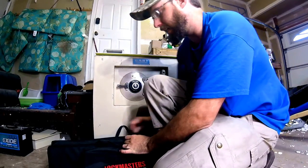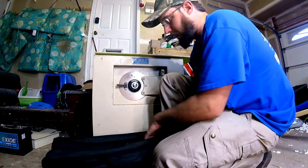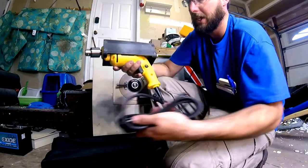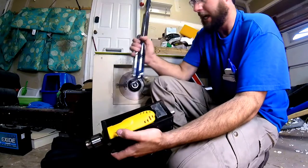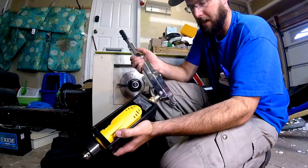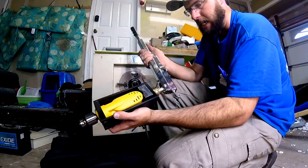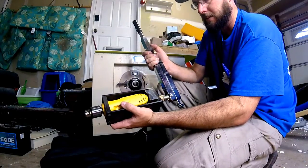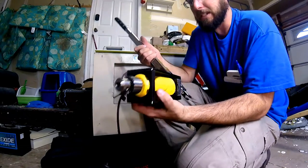The drill rig — the lever rig — is one of the oldest safe tools around, and it's because it's simple and it's effective. Basically what it consists of is a drill motor attached to a box that you can then attach to a lever, or this rig right here, and basically that's gonna clamp on there. Then you've got a chain that clamps to the safe, so you're using the safe as the dead zone, and you're using the safe to pry against itself to gain the leverage to put more pressure on the bit to be able to drill into the safe.